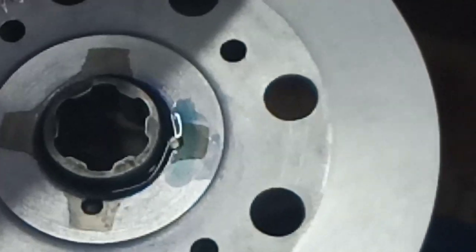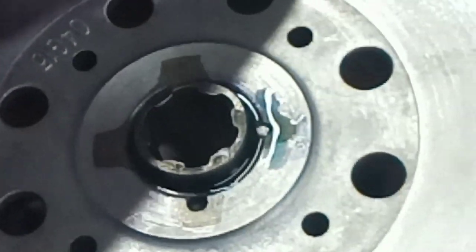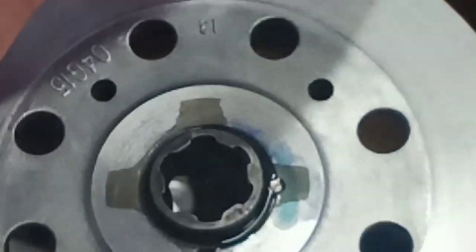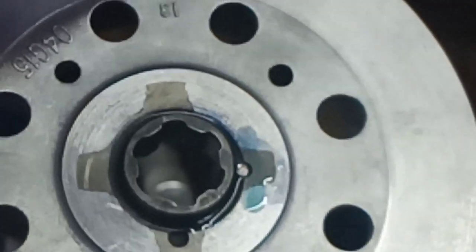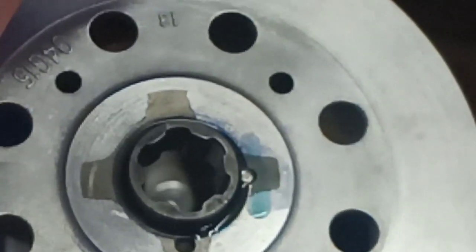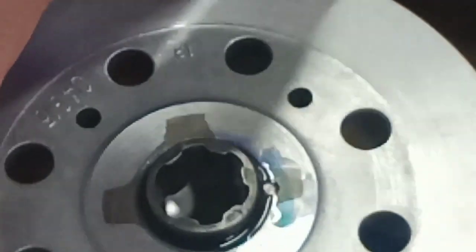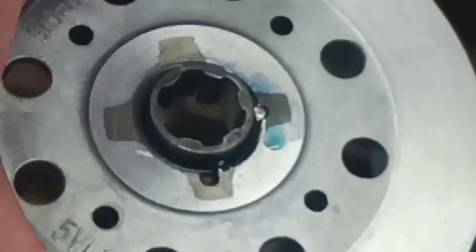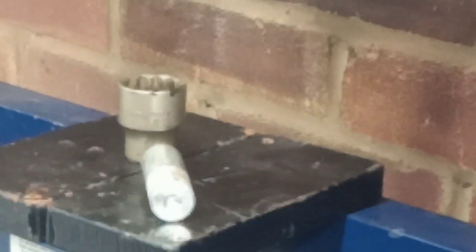So I think that our splined insert is going nowhere. It's certainly not going to fall out because it's Loctited and pressed into the hub. And it's basically in a sandwich situation when it is fitted on the engine. And also, it's not going to rotate because of the pin. So, there we go. Winner, winner, chicken dinner.